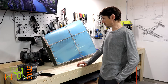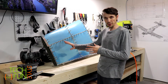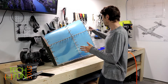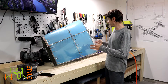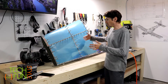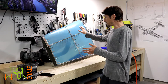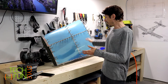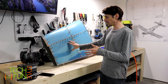So what has been done so far? I have riveted all required parts of the skeleton already. The only two parts left unriveted are on this side - two portions of skeleton - because we will have to remove them to access the inside with a bucking bar for riveting. With the help of my wife and daughter, I put the skin on, so we now have the skin clecoed onto the skeleton.